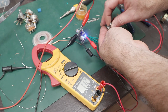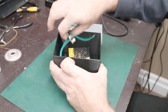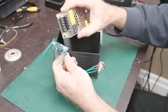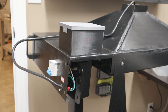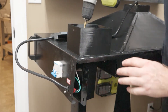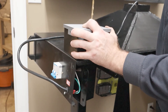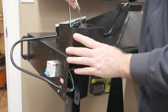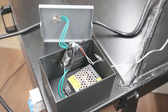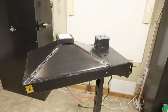When I test this, you can see the voltage change. I modeled and printed a 3D box to put everything into. This is where I'll mount the box to the dryer — it doesn't get very hot back here. I'll drill a hole through the box and the flash to run the wire to the fan. I'll tap directly into the existing wire coming into the back of the flash unit, so I can run the heater and fan independently. I think I'll run the fan for 30 minutes after turning the heater off, just to make sure the heat doesn't rise and melt anything. I ended up adding a push button switch to the lid as well.